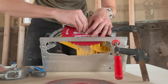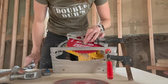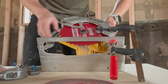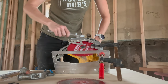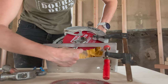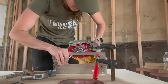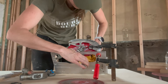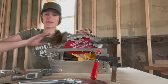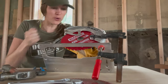Then we're going to hand tighten our bolt at first. To tighten it the rest of the way — if I grab this and turn without the button, it's going to move the blade. So I'm going to depress this button back here again that prevents my blade from moving. Make sure you have it down enough to lock. Sometimes it's easier to reach under, but make sure you don't catch your knuckles on that blade — you could wear gloves if you wanted to. You want it nice and tight, no wobble in your blade, but don't overtighten so bad that next time you go to loosen it you'll have a nightmarish time. I'm going to depress the button and do one more torque just to make myself feel better.